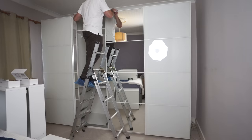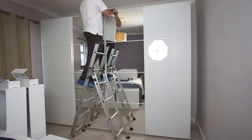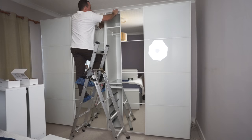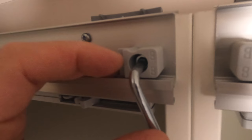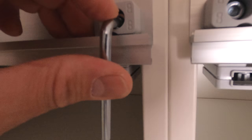Adjust the other stopper as well to reduce the gap in the middle. You can use clear rubber stickers if you want a little bit of gap, or just push those plastic stoppers exactly where you want them to make it easier to open the middle doors. Open the screw, move the stopper left or right where you need it, and that's how you reduce the gap in the middle. That was the 'impossible fix' from IKEA's preferred assembly service.